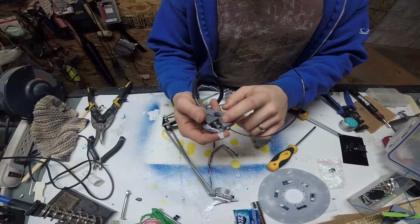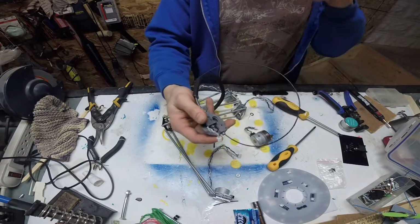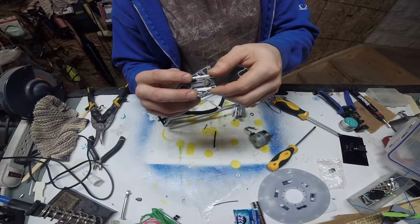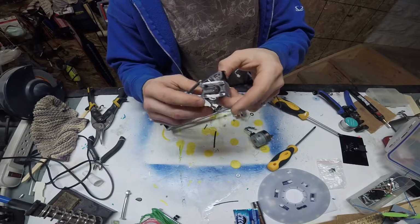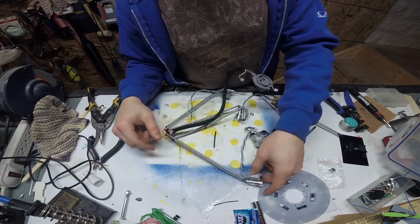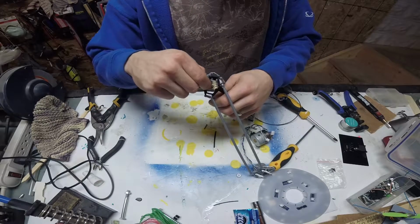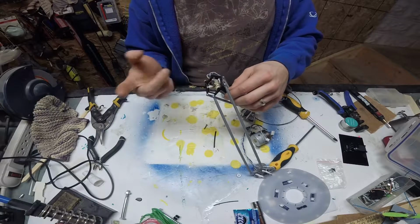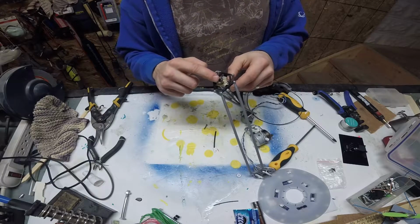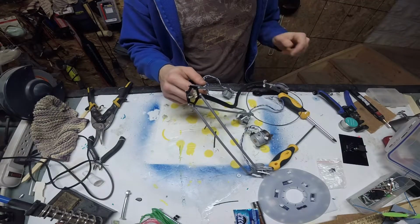I had a failure to load, or I would say there's no filament, because this wasn't depressed. These aren't tight enough, or they're a weak point. This is something everybody's had to mod right away. Apparently the motors are too weak to bounce over the globs that it's creating, which is also another issue. What I've gathered so far is that this is not very accurate. It's hard for me to tell. Maybe my readings are off, but this doesn't really seem to be consistent. Not everybody has the same temperatures.